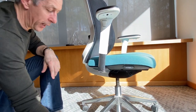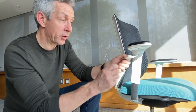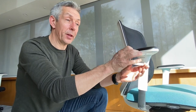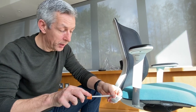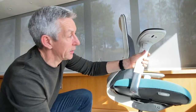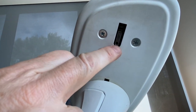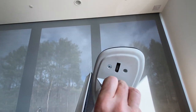Once we've done that, we can then reassemble the machine screw to locate. This is actually a lock functionality, just to make sure that when you're using the arm and getting up out of the chair, the arm doesn't disappear away from you without you wanting it to. I'll just tip the chair up to show you this detail — there's a metal bar inside the arm which locks into the turret, and there's a threaded hole in the back of that bar, which is what I'm trying to locate my screw into.